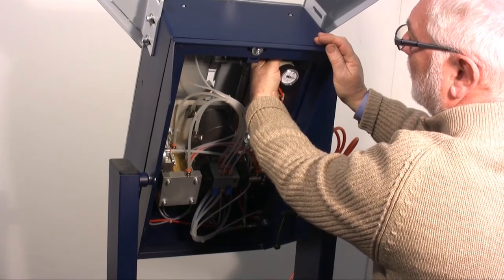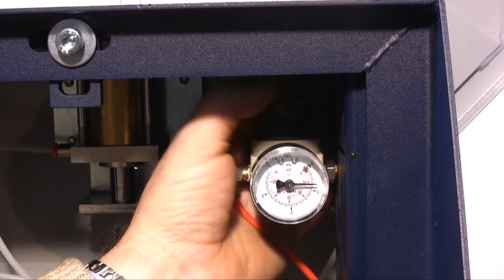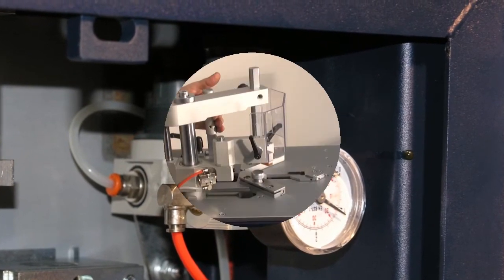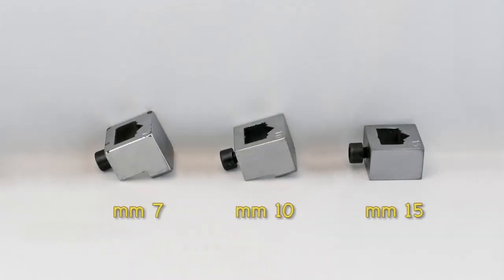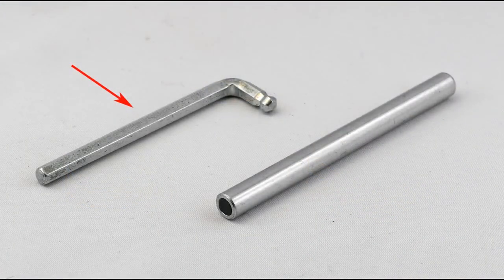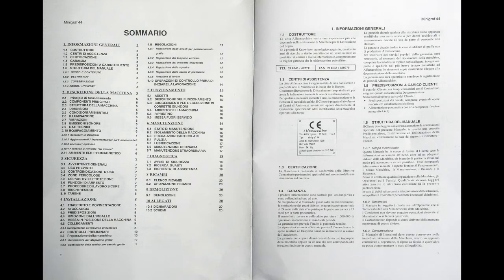The U400S is also provided with a third pressure regulator found under the machine, needed to increase or decrease the mobility of the trolley when it is moved forwards and backwards. The pressure can be changed by rotating the special knob which is found next to the gauge. The provided accessories are 3 wedge heads of 7, 10 and 15mm. The 5 and 12mm heads have to be ordered separately as an optional. Also provided are 2 buffers with a felt base, 1 angular and 1 circular, and a magnet needed to replace them. A 5mm Allen key is needed for the replacement of the heads and for other adjustments. A magnet for the removal of the wedges. An instructions and maintenance manual is provided in Italian or in the other main languages.